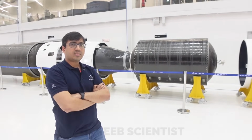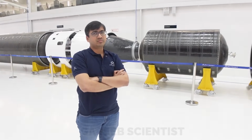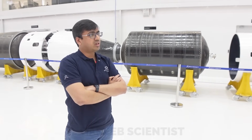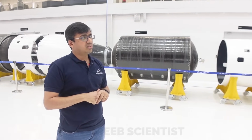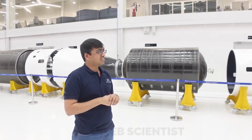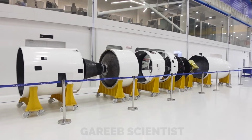What are the challenges of scaling it like this, going from Kalam 100 to a larger one? What changes? Engineering challenges with going big. One thing is that the winding program also changes because the length is different. In fact, lengthier ones are easier to wind, it's better and easier. The third stage shape is more like a football, more round, so it's slightly more difficult to wind.